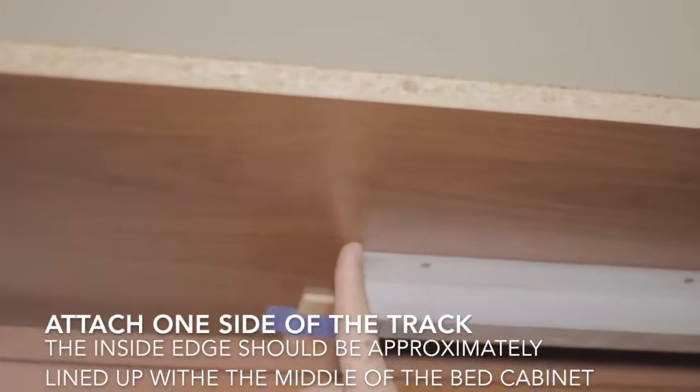You're now ready to start adding your adjustable shelves. You should have received enough adjustable shelf pins for all of your twelve adjustable shelves — put those all in place. Slide the adjustable shelves in, which usually works best by coming in at an angle and then lowering them onto the adjustable shelf pins. If you have doors on the outer fixed bookcases, the adjustable shelves behind those doors won't be as deep as the others. To install your doors, you hammer the hinges onto the doors. For the outer fixed bookcases, use the hinges that are curved — those are inset hinges and they are the smaller doors, if you also have doors on your sliding bookcases.